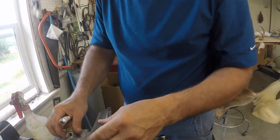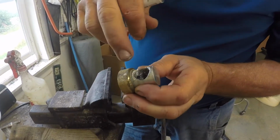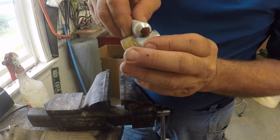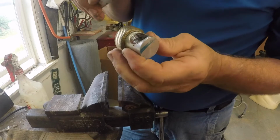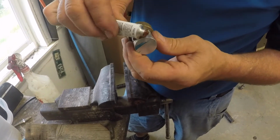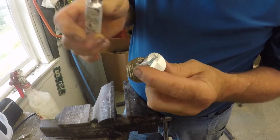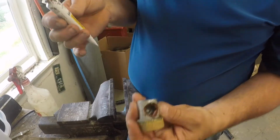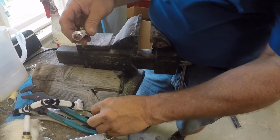And so the problem is right here, that these two high sides in this curved connector scrape all the material out before it can actually get into the bottom of the thread. So using a liquid sealant, I can place it directly into the thread before I put the fittings together, and that way it just gets smeared around, it doesn't get rubbed out. And that should do it.